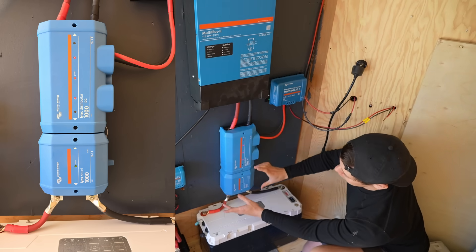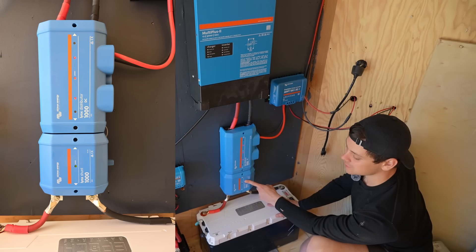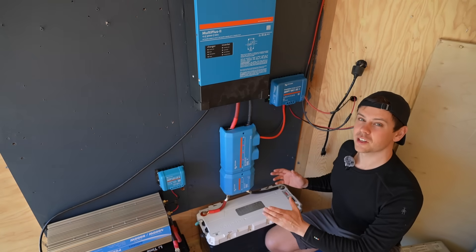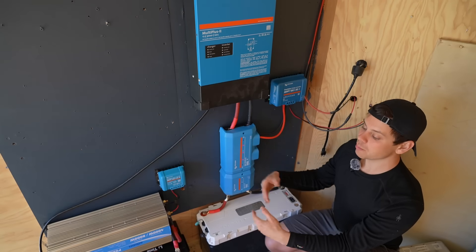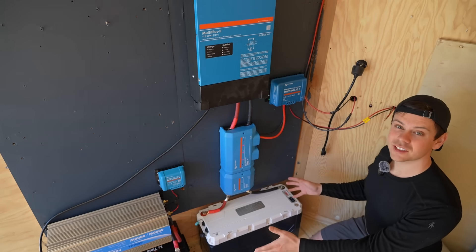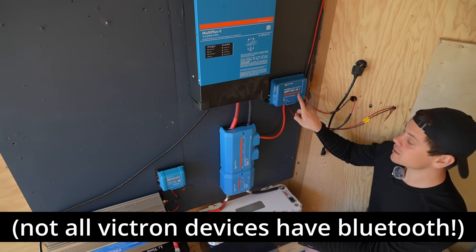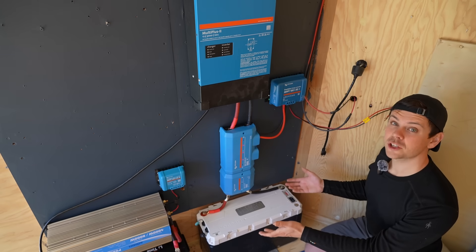The distributor is connected to a Lynx shunt, which connects to all of your batteries. This shunt can tell you the capacity of your battery bank, or you can use Victron communication from the battery to work with the inverter. Victron also sells the Cerbo GX, which will connect all of these devices including the battery, so you can remotely operate and control your system — but that costs a lot of money. Alternatively, you can have these devices work without communication, or check individual components with Bluetooth. For example, the solar charge controller can connect to your phone so you can see how much power is coming from your solar array. It's really up to you and how much you want to spend.